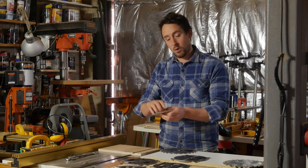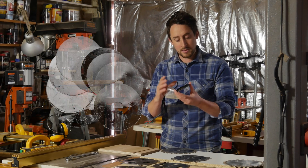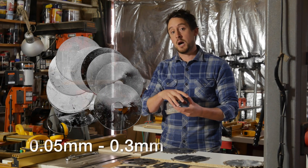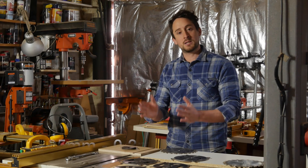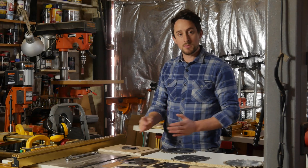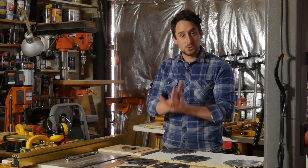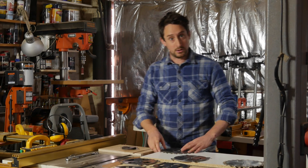In addition to that you have a whole range of these little shims, which as I said are all metric. There are about 11 here, ranging from 0.05mm up to 0.3mm. What that allows you to do is space these blades to get really precise measurements, get beautiful tight fits — dados when you're making joinery or rebates. It's very easy to use and you'll get great results.